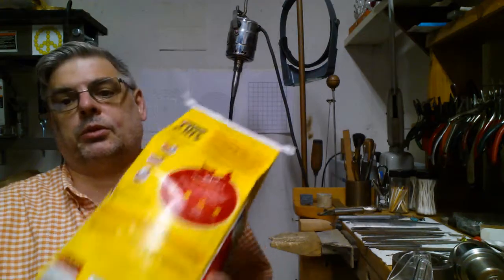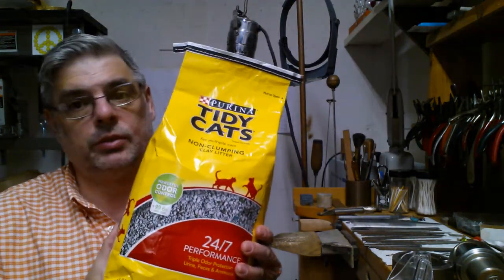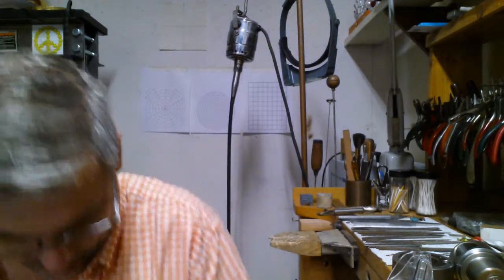Also, have a basic spill cleanup kit in your shop. A basic kit will include a roll of paper towels to mop up spills, a container of baking soda like Arm & Hammer to neutralize anything acidic that you might spill, and my favorite — a bag of unscented clay kitty litter. A ten-pound bag: if something liquid spills, throw that down. It keeps it from spreading, soaks it up, and neutralizes it to a small degree because it's clay. It's much easier to clean up a little mound of wet clay than a big wet spot.